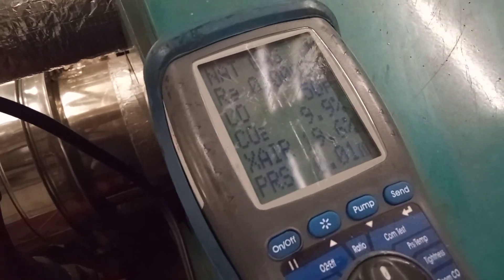It's good to keep an eye on this when the boiler is going through the firing sequence to see that your flame strength is nice and strong. I'm getting some combustion readings now in high and low fire, but I think I'll make some adjustments because although my combustion looks good, it's making a lot of noise. So I'll adjust the air and gas. Until next time, bye bye!